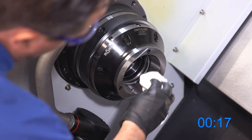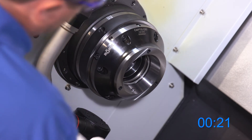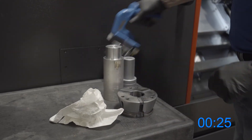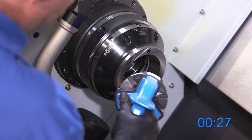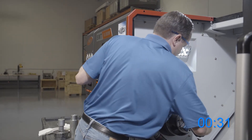I'm going to inspect the collet taper, make sure we clean it — there's no chips. Then I'm going to insert the collet wrench into the new collet, compress the collet, line up the timing marks, and insert the collet.